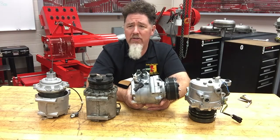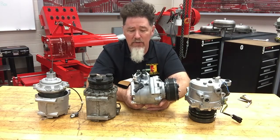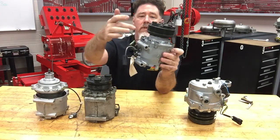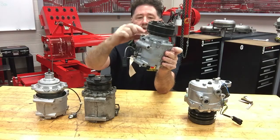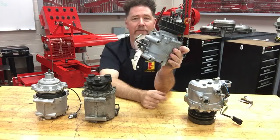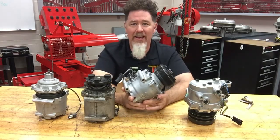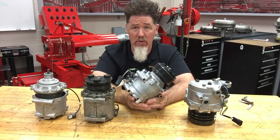When you start looking at a scroll compressor, it's hard to imagine what it is if you've never seen one before. I have some cutaways and we'll take a look. For identification, the scroll compressor comes apart from the front — we typically have four sets of bolts, so eight bolts total that you undo. The nose is very unique looking. I don't recommend taking it apart, and I'll tell you why. If you do take it apart, good luck getting it back together — you want to mark the housing very carefully because it has to go back exactly the way you took it apart.